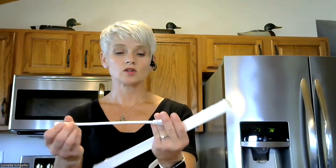There is a cap on how many you can connect — it's 360 watts if you're not using a dimmer. If you are going to be dimming these, they are only compatible with a triac dimmer, and when dimming you can only go up to 120 watts connected end to end. If you don't want to connect them end to end and want a spacer in between, we also make junction cables and connectors in a couple of different sizes — check the spec sheet — and they plug into the end so you can make your run and bend around a corner.